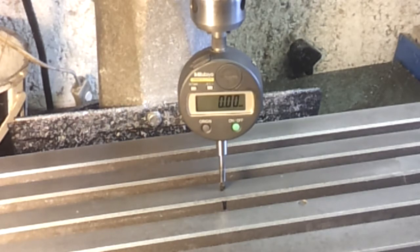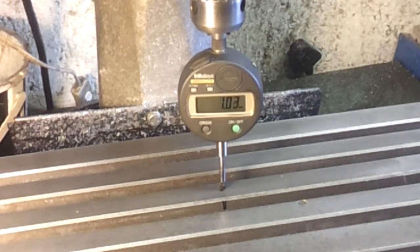Let's see what happens if we move down to a lower resolution — let's try 100 microns. That's spot on. Counting up: at step 6 we're 10 microns out, at step 8 we're 20 microns out, and there's our 30 at step 9. That's not looking too bad.